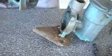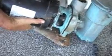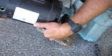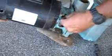Let's go ahead and put on our new volute gasket. A lot of different makes of these, some of them thicker, some of them thinner. Plug it into our volute. There's a little shoulder on this thing, that you can get the bolt started, and actually if you don't get it to where it seats all the way before you start the bolts, to where this little shoulder sits over the top, well, what's going to happen is it's not going to seal up, and you'll know it when you fill up the trap because there's going to be a big leak.